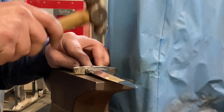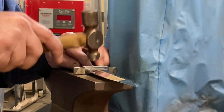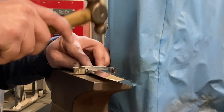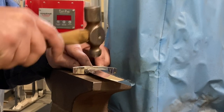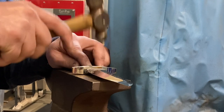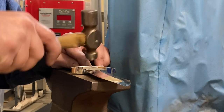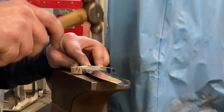It's important to use the tapered reamer or some form of way to open up that pinhole into a cone shape so that you can spread that pin out, or else when you grind all this material that I'm spreading now and the hole is just perfectly straight, you're gonna shave off everything that you've spread out, and it's just gonna be a straight pin in there and it's just gonna fall out.